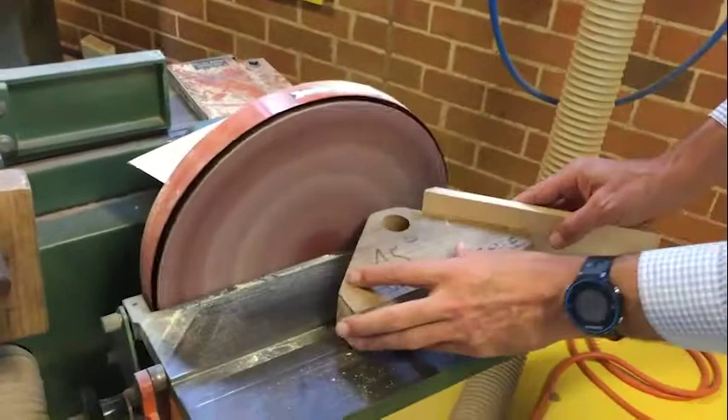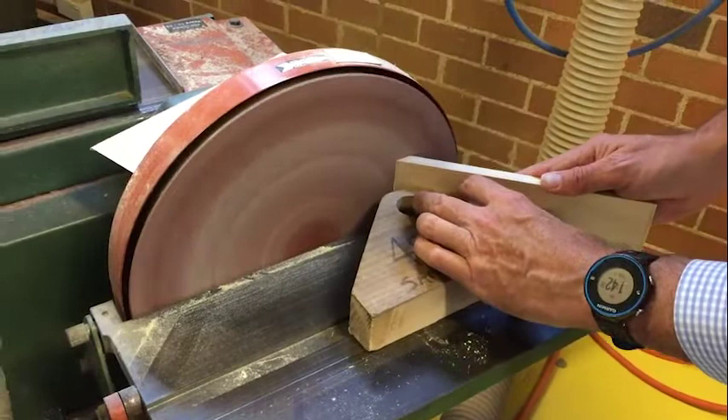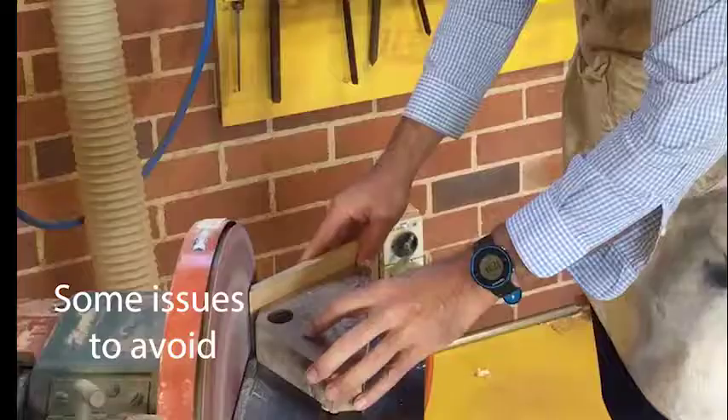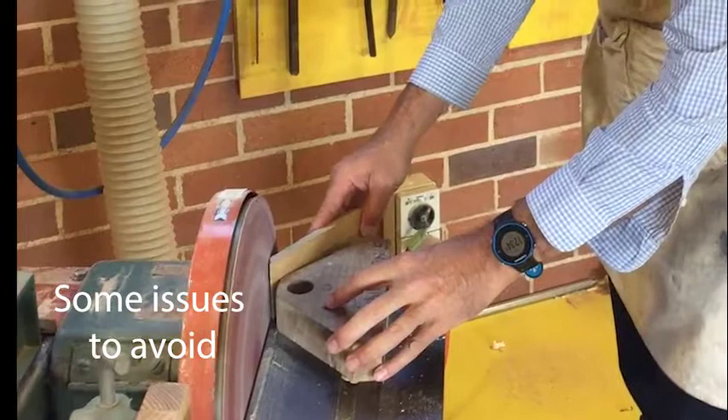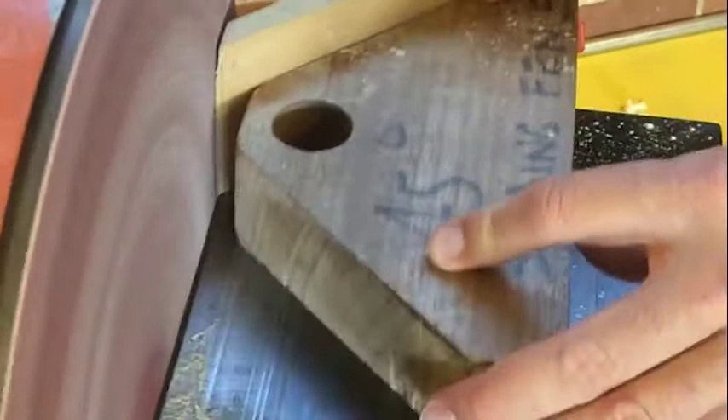So we've got our line here. Just gently holding on to the workpiece. You check it to make sure it's right on the line — which it is — and that's done perfectly. Start sanding as it pulls away like that, and also lifting it up so you're not getting it going across like that, so try to keep it flat and on the fence. You only have to push gently in and you can just go across like this.